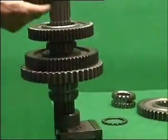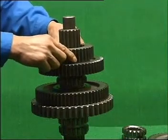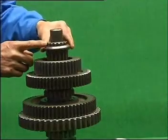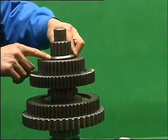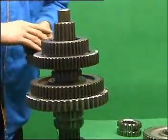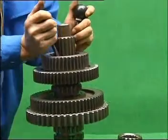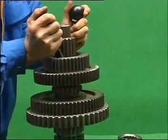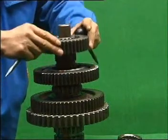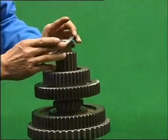Install the third speed gear and spline gasket onto main shaft with the contact teeth upward. Mount adjusting gasket onto main shaft with the convex side upward. Embrace the adjusting gasket with the point of two ball head driver so as to rotate it. If it doesn't fit, find a suitable adjusting gasket instead and move the hex upward.